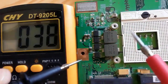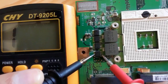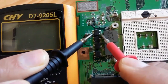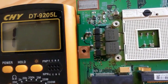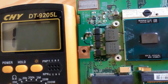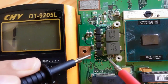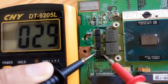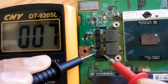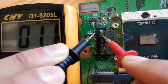Let's remove the CPU and check the MOSFETs again. Normally we should find a high resistance. As you can see, we have an open resistance reading. But if we install the CPU again and check, we find 0.08 — a very low resistance. So this is not a short; this is a very normal result. Pay attention to this point.